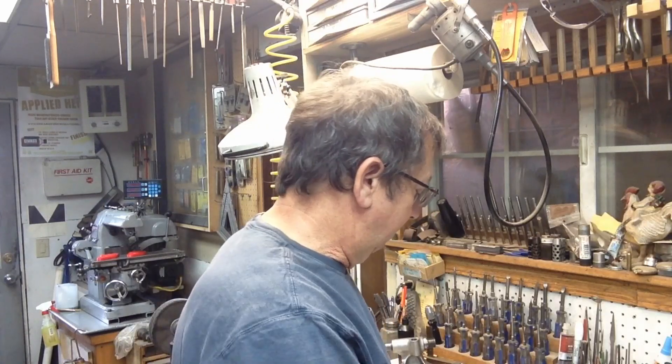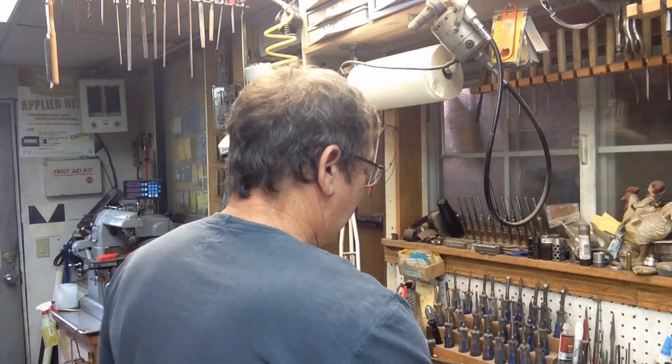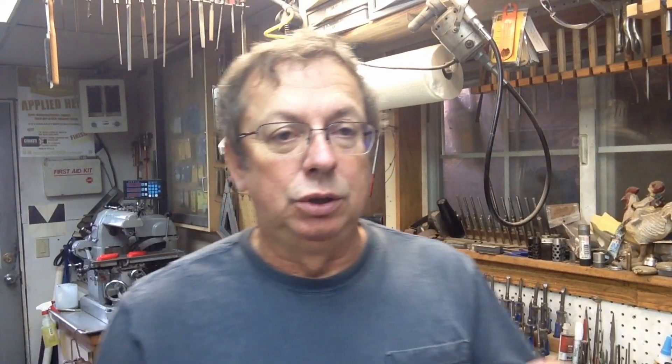What I did when I started out doing these was I drew them up in CAD and CAM using Fusion and scaled them there. Then I 3D printed out a pair of them, which would be a set. A couple of reasons for it: one is I could physically look at the size and feel them and see if it was what I wanted. The other was I could nest them to best utilize stock. What I found out is I can put them on just a piece of aluminum — for this size it's 3/16ths thick. That's what I ended up using. It's 2-inch wide stock and about 3-1/4 inches long, which gives me a little extra material.